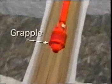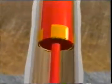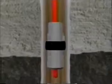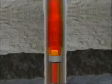The retrieving assembly, with a correctly selected grapple for the packer bore, is run below hydraulic jars, collars, and a boot basket, which collects metal debris cut loose by the shoe. The spear and extension in the assembly is lowered through the packer. Milling over proceeds until the packer is milled free. The spear engages the packer body and it is removed from the well.